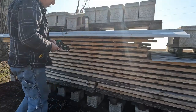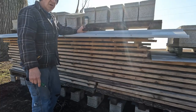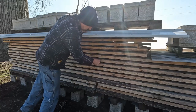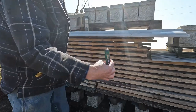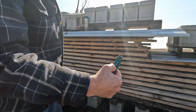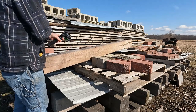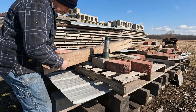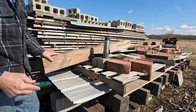So this is red oak, 1.5 trailer decking, cut this summer. Leave it on number 2. There's a 14.8. I've got it held, so then you press it again and it unholds it. Oh, the needles won't even go in. That's how hard this edge is. I can't even get the needles in. There we go, there's a 9 reading.